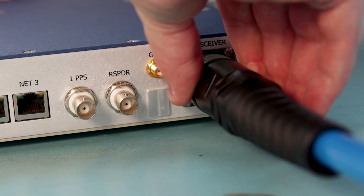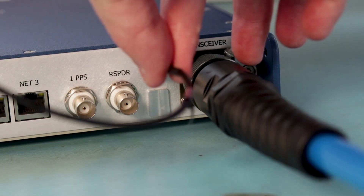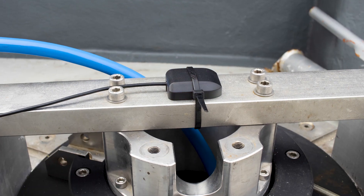You can see our other video on how to deploy your MRT transceiver by clicking on the link on screen or in the description below. The ESH comes with an internal GNSS system and a provided external antenna, which is plugged into the port marked GPS on the back of the unit. This is used for time synchronization and basic positioning. Ideally, this should be mounted outside to get the best signal, and for perfect positioning it should be placed on top of the transceiver pole.